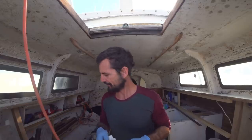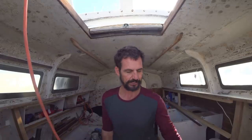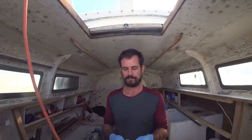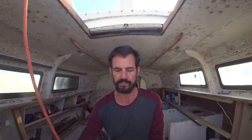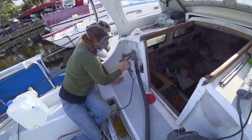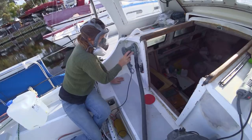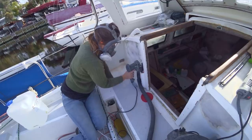Of course once you have good tools they're not disposable — you've got to look after them. It's Saturday so I'll just get off the boat, because the only thing going to cause extra chaos is me. I can save a lot of problems just by getting out of the way and letting that resin cure — there's nothing worse than having a glass job nearly set up and bumping into it. The last step is to coat the fiberglass with epoxy mixed with Q-cells or microspheres, giving a filler that is easily sanded to a smooth finish.